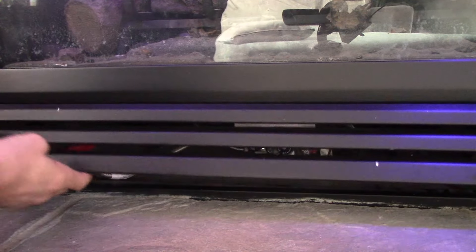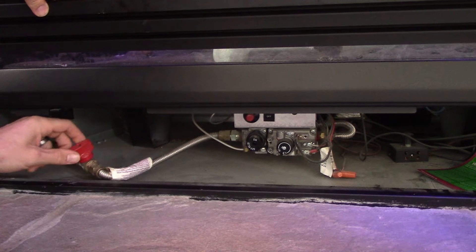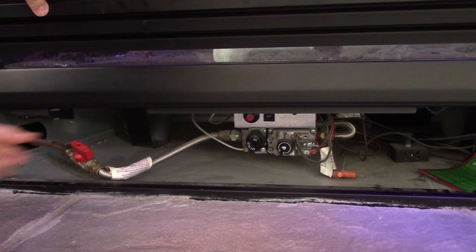So let's go through the steps together. Number one: locate the shutoff valve for your appliance and make sure that it's turned on. If the gas valve for your appliance is turned off, you're going to need to turn it on before you can light the pilot. For most appliances, you're going to have a gas valve in the same room and within six feet of the appliance.